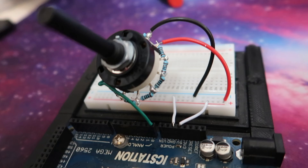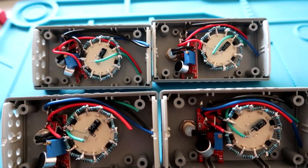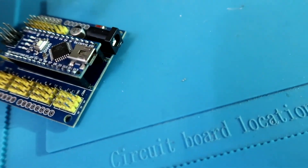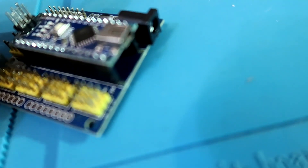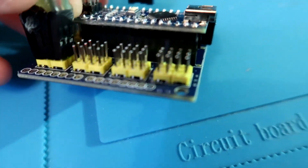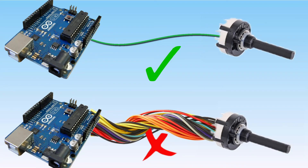You can imagine how many pins that would have taken up on the digital side if we did it the traditional way. Even for one of my projects, I ended up putting it inside a little box which fit nice and neat. I created a whole bunch of things and had it all inside the box, and it all still ran out to just an Arduino Nano. For all four of those boxes, they only needed one analog pin, one positive, one negative, and a digital for another device — look at how little room was taken up for all four boxes compared to using the digital method.